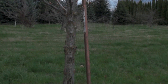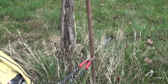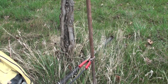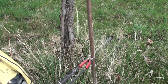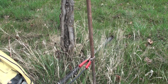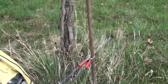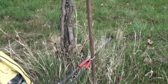If you look closer you can see that is a ground rod - it's only in the ground about two feet. We've had a recent rain so the ground is really wet. What I'm going to do is put 120 volts into that ground rod. I've got a cord that runs from the other side of the 120 volts: the positive side hooked up to the cord and negative side hooked up to the ground rod. I'm going to go about 200 feet and see if I have power at the other end.